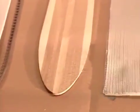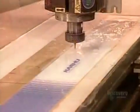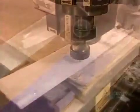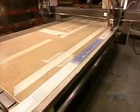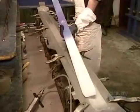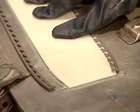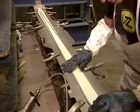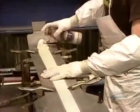One way to make cross-country skis is compression molding, a process that uses heat and pressure to bond the components together. First, a computer-guided blade cuts out what will become the ski's underside, called the gliding surface. It's made of pre-assembled fiberglass laminate and polyethylene thermoplastic, a friction-resistant material. They lay it into the bottom half of a mold, then glue on steel edges for grip.